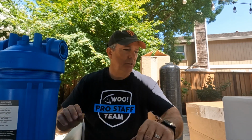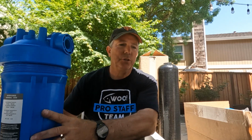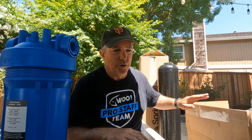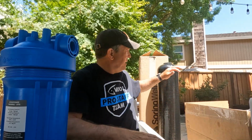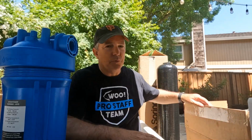Now all I do is get it installed. I put a little pad on the side of the house over here in the backyard and a little shed. I'll put this in the shed, and I have to get under the house, cut the water line, and splice into that and everything. So that's the next project coming. I just wanted to share that with you. The Springwell water filter system, it's a CF1, and this is expandable. If I wanted to go to a water softener system, kind of the next stage, I can always buy that second tank for the water softener. It's kind of like this one, but just a different media on the inside for water softening compared to water filtration. And that's always down the line.